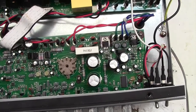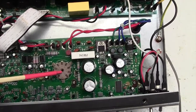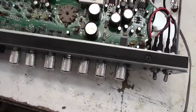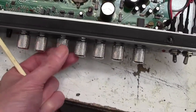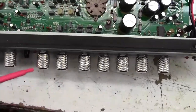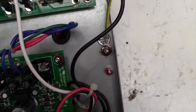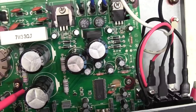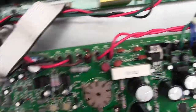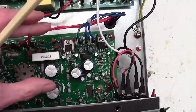Just briefly, before I take the board out, I thought you'd like to know how to do it. You have to remove the valves first, because they're plugged into these bases. Then I'm going to take all the controls off — a lot of these are very loose anyway, see, that one just rotates around. I'll take all the control knobs off, take all the nuts off that hold the shafts on, take out these screws — one, two, three, four, five. And then the board should just joggle out like this.